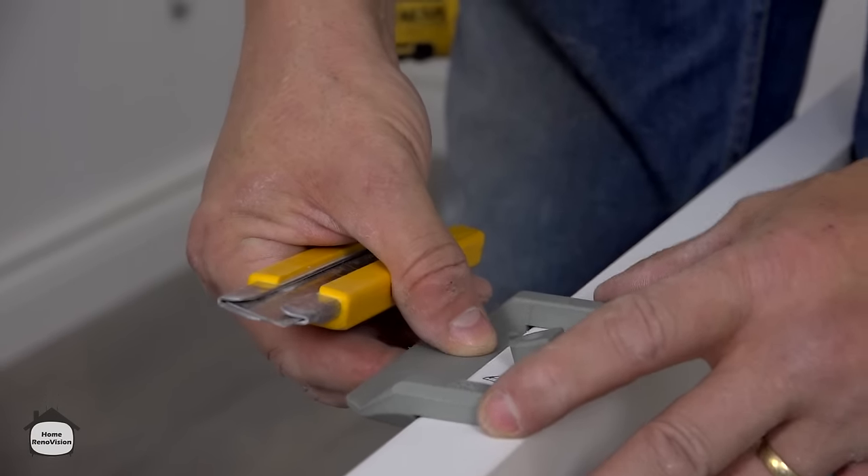Check the instructions for these roller balls when you're at the store — this one comes with a 15/16th requirement for a drill bit, so I had to buy a specific blade just for that. These balls are on springs. If you take your knife closed and push the top of that ball, you'll catch those two little pins. It's like a massive slot screwdriver, and you can actually raise or lower where that ball is so that when it comes to the door it's the perfect amount of resistance. With resistance, it'll push past the plate and then sit back in the cradle again.